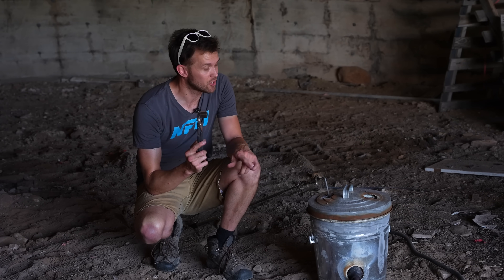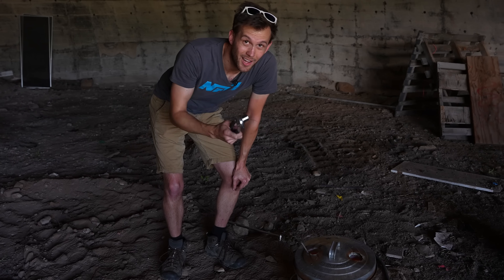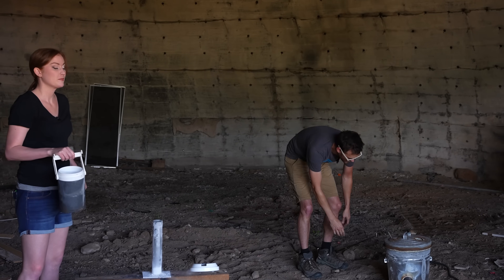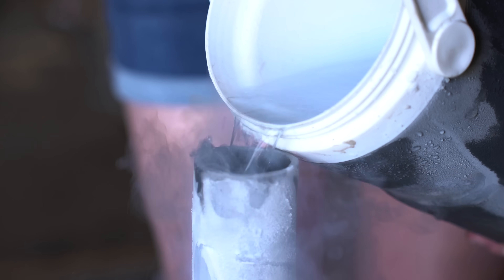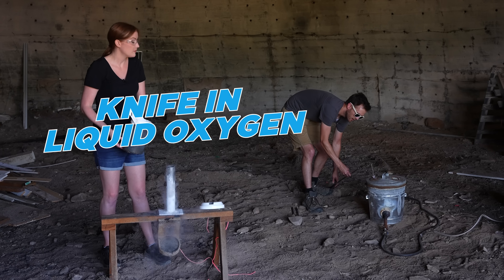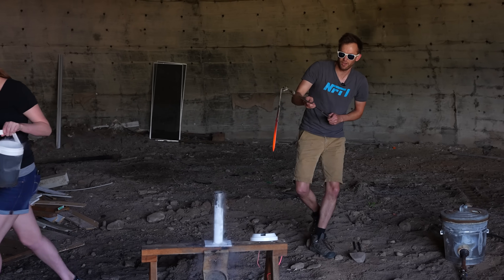Right here I've got a pretty powerful magnet. This knife is made of 1095 steel, so when it gets warm enough that it is no longer attracted to the magnet, we know it's at the right temperature for quenching. Not attracted to the magnet — that means we're at a good temp. I expect this will be mostly boring while splashing a little bit of oxygen out of the top, but maybe it'll be more. That's full. All right, good to go. Here goes — three, two, one.